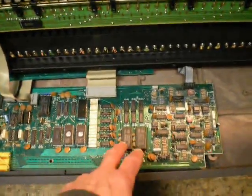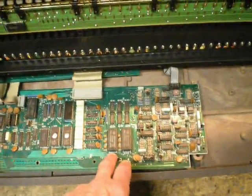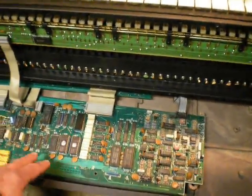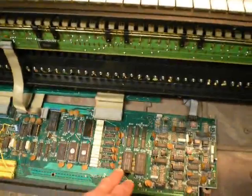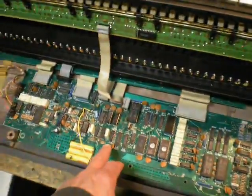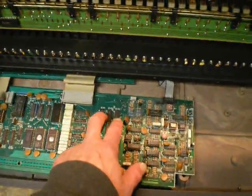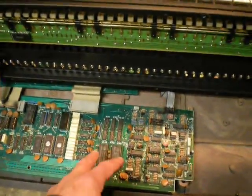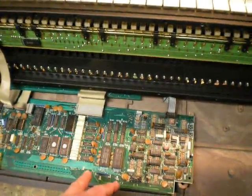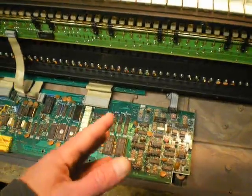And then you've got the actual sound generation hardware here. These are the TMS-3631, which is poorly documented — I can't really find any. If anyone has documentation, send it to me by all means. But it takes codes from IC17 here, which is what we're currently going to show you. There's an issue with this one, even though that chip doesn't look like it took any damage. Very strange. Anyway, these are the buffers — actually they're AND gates, and they get selected. The output can be turned on or off, so it's just producing square waves out.